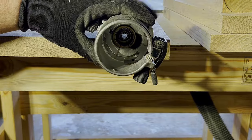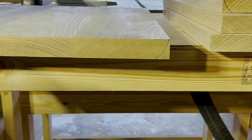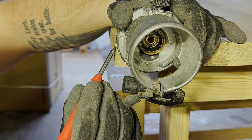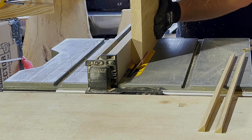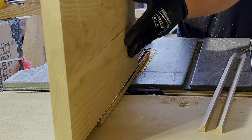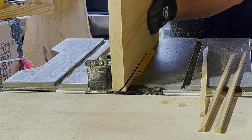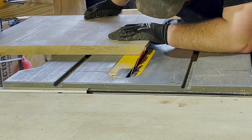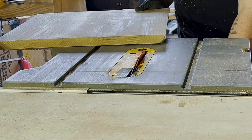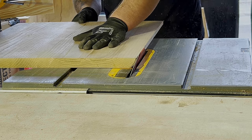One of the things I had to take into consideration when building my wife's coffee table was that our son is eventually going to hit his head on things regardless of what we do. The idea was to mitigate stitches by getting rid of big sharp edges — I put a giant half-inch round-over on every sharp edge and rounded all the corners with a nice big radius. I tried to continue that theme here using a small router base to draw these big round-overs. I didn't have a router bit big enough, so I used a technique I saw Keith Johnson use — removing the bulk of material with the table saw and finishing off the finer details with a hand plane and sander.